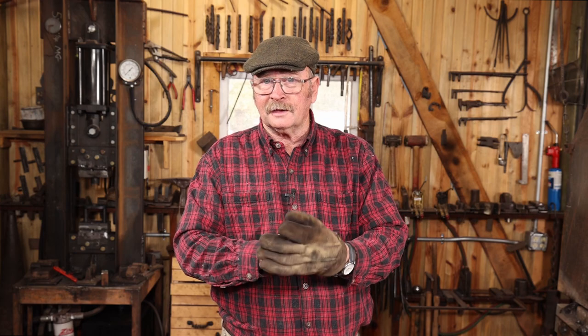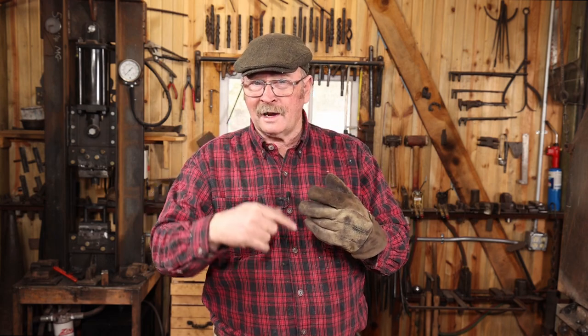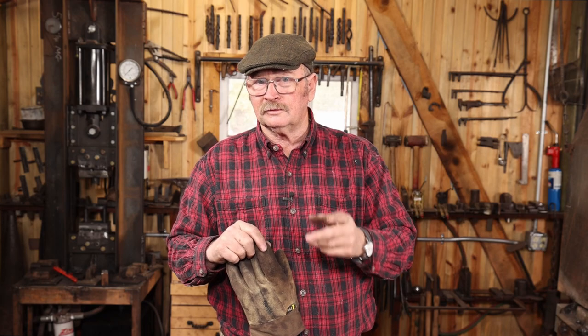But the absolute biggest danger to wearing gloves in any kind of shop situation — whether it's a blacksmith shop, a machine shop, a woodworking shop — is having gloves on around machinery. Things like milling machines, lathes, shapers will grab a glove, especially a cloth glove that's kind of loose, and it will wrap that glove up in the machinery. It doesn't care if your hand's in that glove. The glove is probably not going to tear away as fast as you would like it to. I've encountered enough people over the years that have severe, life-altering hand injuries because they got a glove stuck in a piece of machinery, and it wrapped their hand and arm up until it stalled the machine, tripped the breaker, or until something tore free. That same incident with your bare hand is probably going to result in some lacerations — you might need stitches — but you're probably going to be back to work within a week or two instead of months of surgeries and physical therapy.